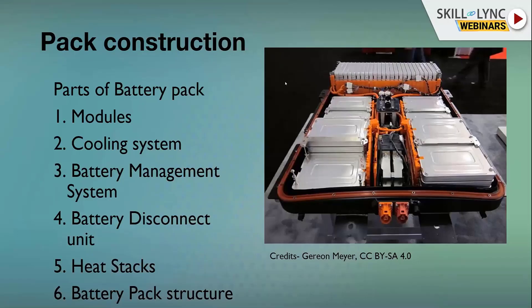This line shows different modules within a battery pack. The pack is your overall enclosure that attaches to your vehicle. It contains the modules, the entire cooling system, cooling lines, the BMS, and sensing circuits inside the battery pack. One more major component is the battery disconnect unit — it has to be electrically disconnected when the cover is open so you don't get electrocuted by touching the terminals.